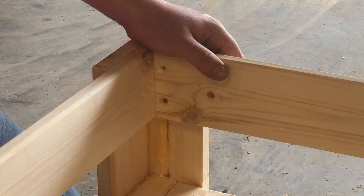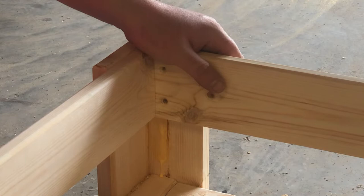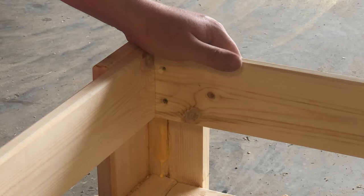Assembled, we're going to start working on the part that's going to be the cab of the tractor. We want this to be removable just in case we ever need to take it apart to move rooms or make it easier to move or whatever. So we're going to be using some wooden insert nuts and some 1/4-20 bolts to attach the cab part to the bed.